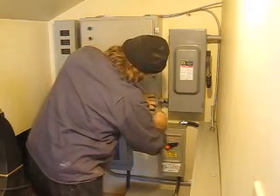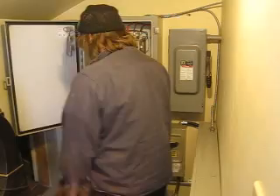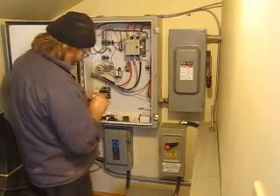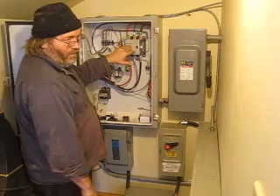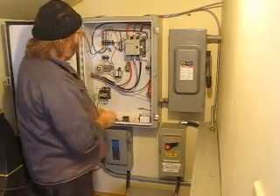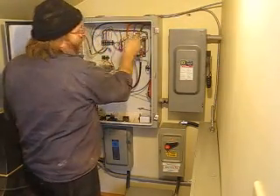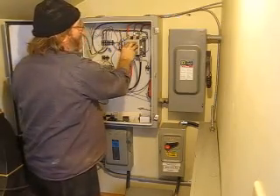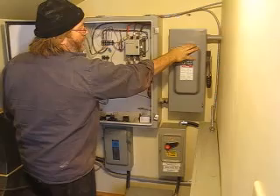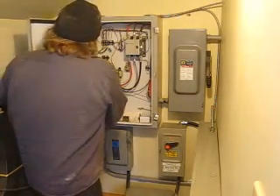These are the best types of control boxes — they're gasketed and sealed, so they keep dust out. What we've got going on here is a number-three magnetic starter rated for 90 amps. It's NEMA-rated with a little auxiliary control, and these are all my control switch wiring running throughout the shop. Once the signals are made, it closes the contacts and feeds power from the main service disconnect into this box.